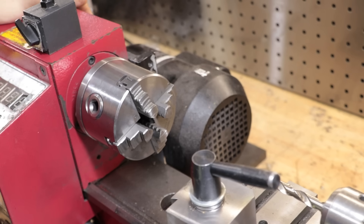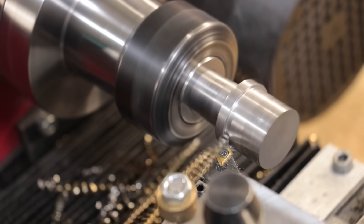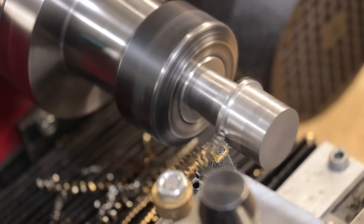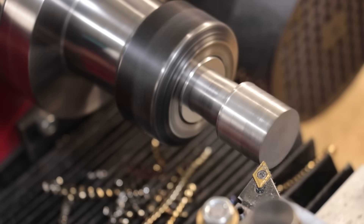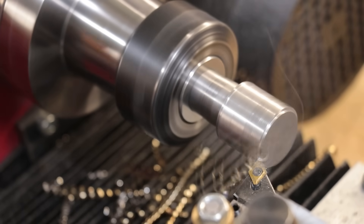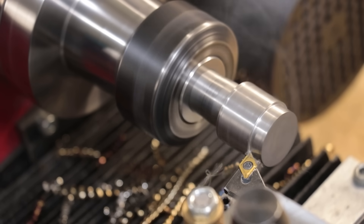It ended up being a lot cheaper to buy a whole drill press, rip the motor off, and attach it than to buy a motor by itself. I do like this setup — it was a simple fix and these single phase AC motors are quite powerful. The big downside is that they're fixed speed. The motor spins at 1400 rpm, and while I could vary it slightly by moving the belt, the lowest speed I could get on the lathe was about 600 or 700 rpm — I was spinning the lathe way too fast and burning up a lot of tooling.